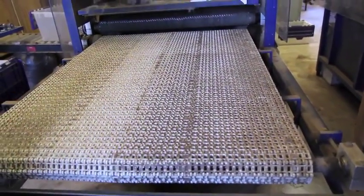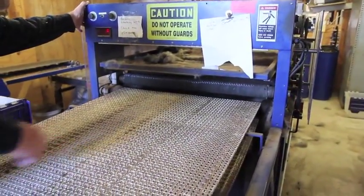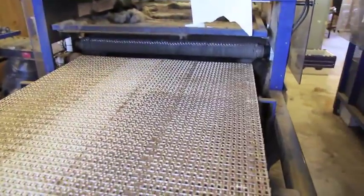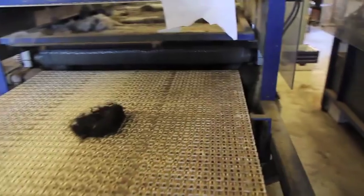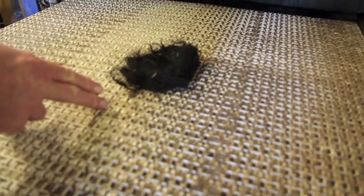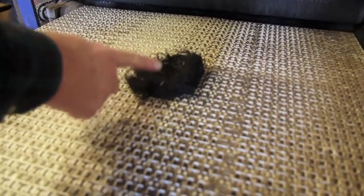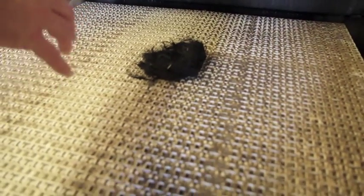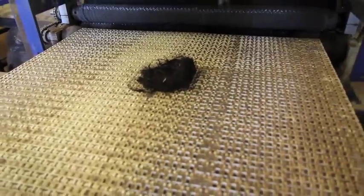They actually take the fiber in and process the fiber, and you can watch the thing here. It moves at a snail's pace. I'll show you how slow the fiber moves. That's why we have 2 of them, because it takes quite a while to process the fiber. It's trying to get rid of any vegetation like that out of the fiber. So as it goes over the drums, works the worker and stripper, coarser fiber falls below. Fine fiber goes out the back of the machine.